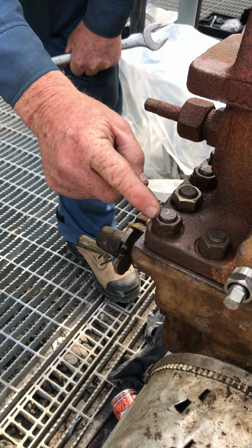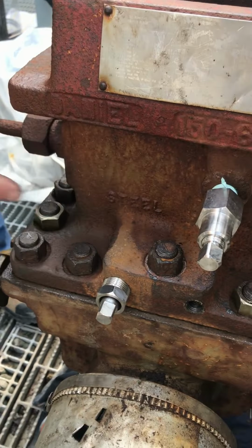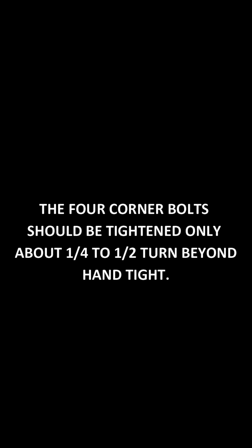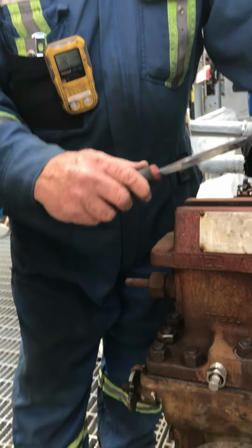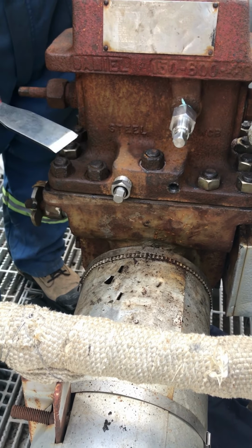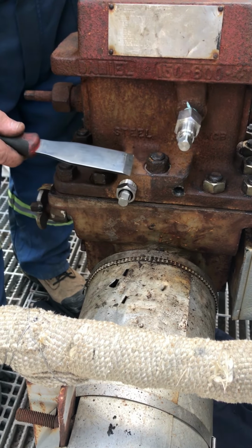You do not touch the corners until the last thing, and then I'll show you how much you do. Other than that, you tighten from the center out, and you tighten them. Can't hurt them. So if this head is leaking, you go back on there with the wrench, you start in the center again, and you give her a little more, little more, little more. If anything, you loosen the corners off, then come back on the centers and tighten. Work your way out and keep testing.